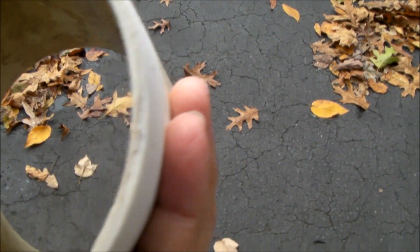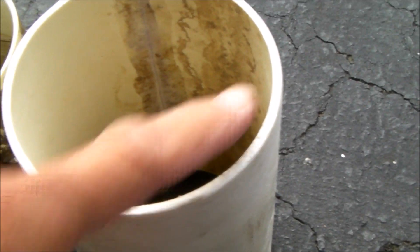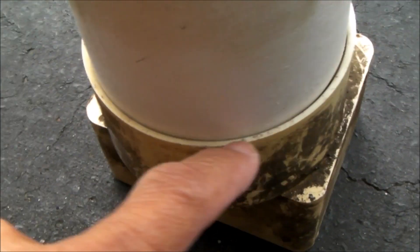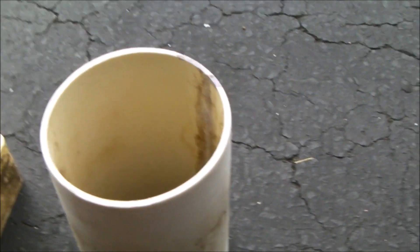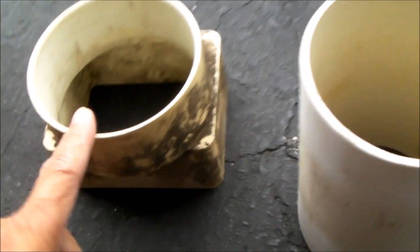I will give you one suggestion. This is going to be a little snugger than I'd like, but it's going to go in there. By taking a little section out, you don't have it perfectly round anymore. I would recommend you go just a little bit smaller than whatever you think it is. You can see it's smaller here, but as it gets back in this section it gets pretty tight again. Too big is a problem after all this work, so you're always better off being just a hair undersized — next time I'll do it a hair undersized, not as tight a fit.